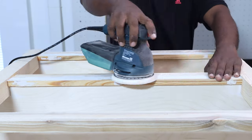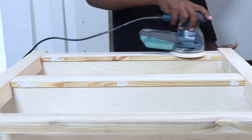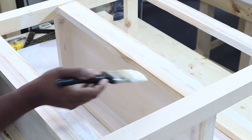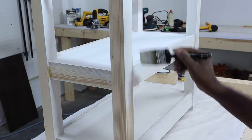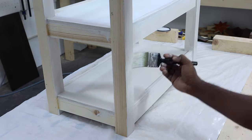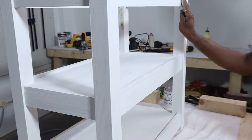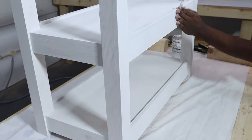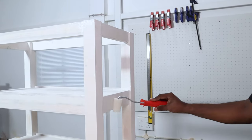At this point the wood filler we had applied had dried, so we sanded it down using our random orbital sander. We used Rust-Oleum chalk paint for finishing the frame of the kitchen cart — for the first coat we painted it using a paintbrush and for the second coat we applied the same paint using a foam roller. If you're using chalk paint you don't need to use a wood primer. We hand-sanded it lightly before applying the second coat, then left the frame to dry for a day.